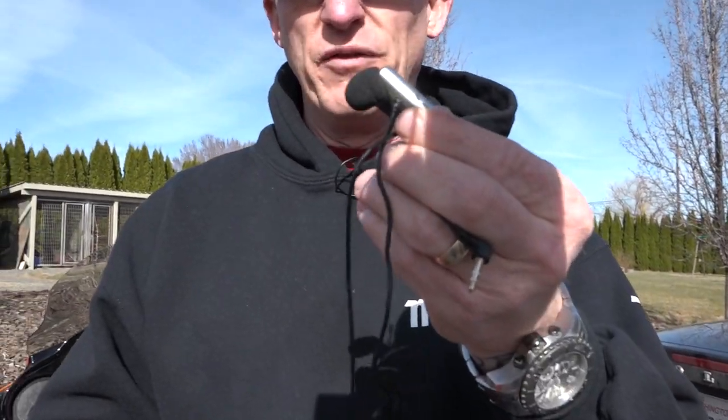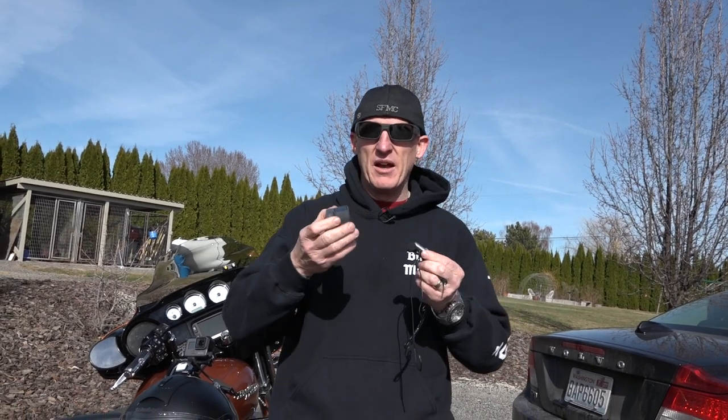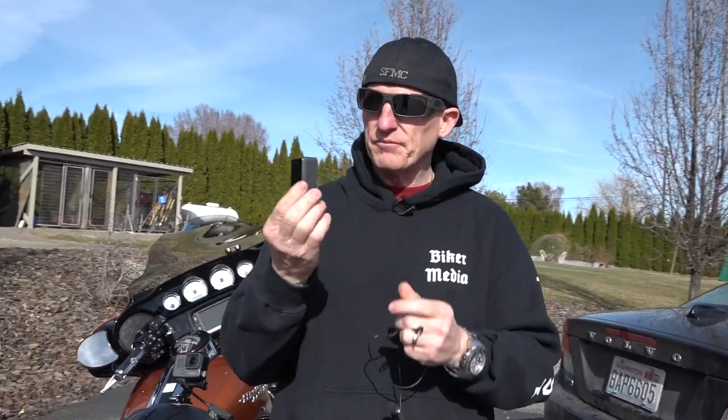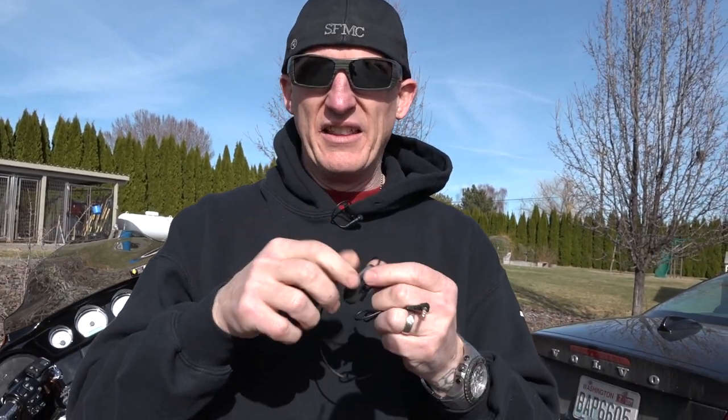This microphone, although we've loved it for years in the Moto Vlog community, is no longer good — at least at high speeds or freeway speeds with the Hero 5 Black. Through my testing I believe it's because it's an Omni Directional Stereo. It's not a hardware problem per se — it's not a connection issue with the 3.5mm jack or the new USB type connection. It has something to do with the stereo on this mic that the GoPro Hero 5 Black doesn't like processing, giving us that popping or clicking — kind of a peaking noise.